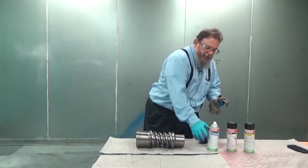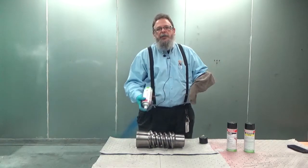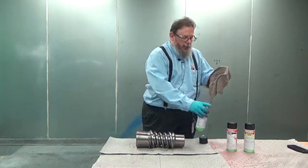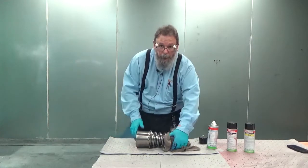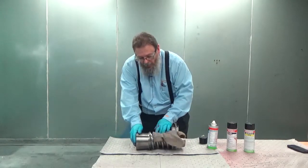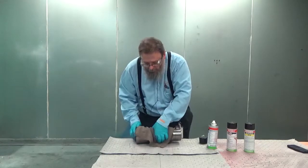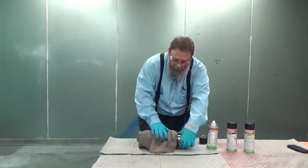This spray cleaner must never be sprayed directly on the part, otherwise it could ruin your indications if there are any available. You spray the solution on a rag and then begin wiping the part. You wipe the part until all of the red is gone and the part is no longer pink and is absolutely clean.